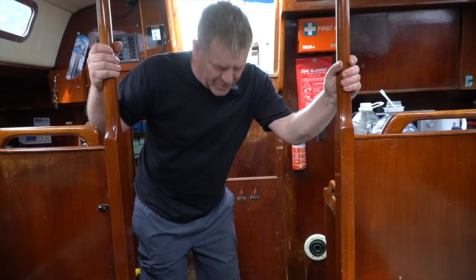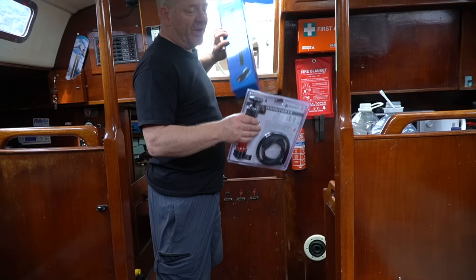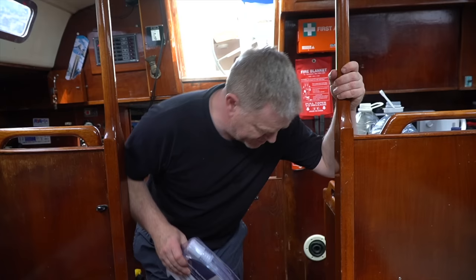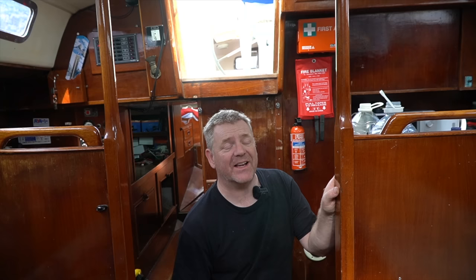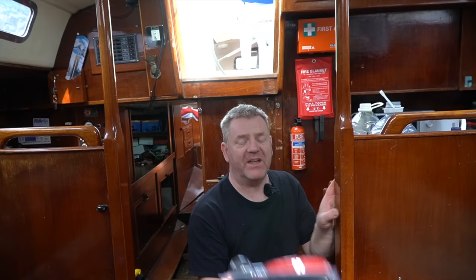I've got 90% of the water and stuff out, but inevitably some of what's in there is oily sludge and the whale pump just won't do it. The annoying thing is I've got a pump at home specifically for transferring oil and doing oil changes — but of course it's at home. I've bought a jiggler from the local chandlery, but I don't think that's going to do the job since the receiving container has to be lower than the tank, and it's in the keel. I've also bought a liquid transfer pump and another one that says it'll do oil and water.